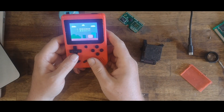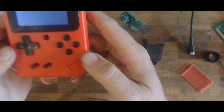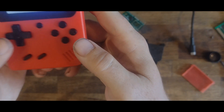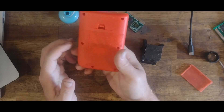It's basically a NES-on-a-chip with a bunch of games. The problem is, if you can hear the sound, it's playing at about 1.3 times the speed. That's because they've used a PAL ROM on a NTSC NES-on-a-chip.